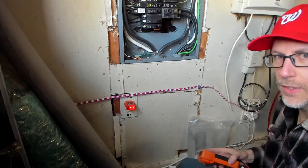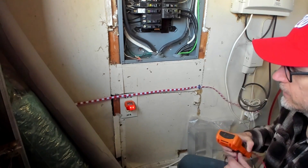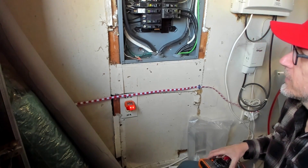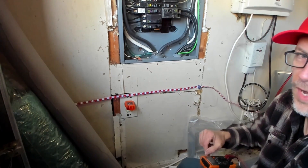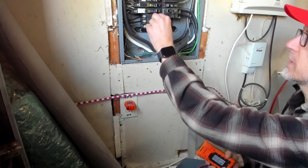I'm not seeing the weird voltage drop like I saw before - it was actually dropping to like 117 or so for no reason, so there was probably something wrong with that old breaker. Be safe when you're doing this. I always like to have positive tests - if I'm working on a circuit, turn it off and verify that it's not on before I even start working on it, and not just assume that switching it off works.